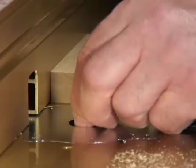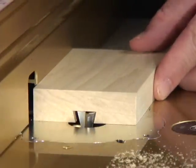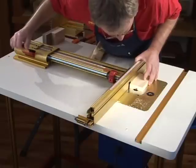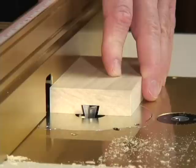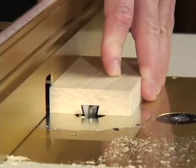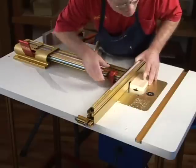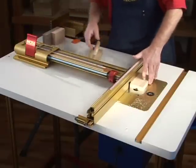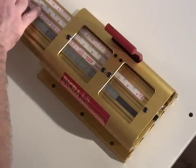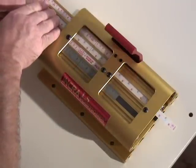With the cutter at its widest profile, slide the centering board up to the bit. Holding the board against the fence, unclamp and move the fence to visually center the cutter within the groove. You can fine-tune the position using the micro adjuster. When you see an equal gap on both sides of the cutter, lock the carriage clamp in place. Now slide the joinery template to align the suggested center cut directly under the hairline cursor.